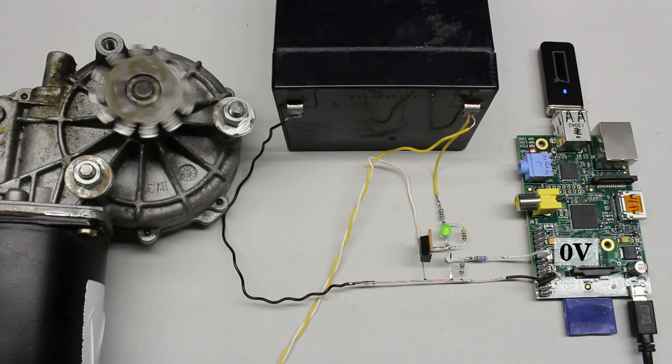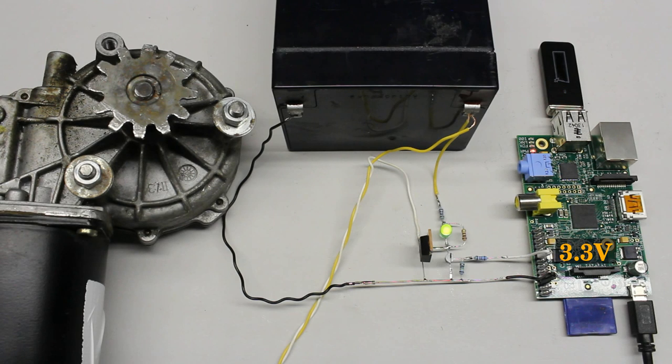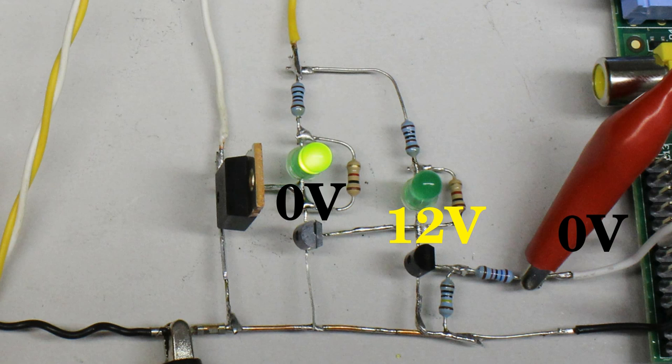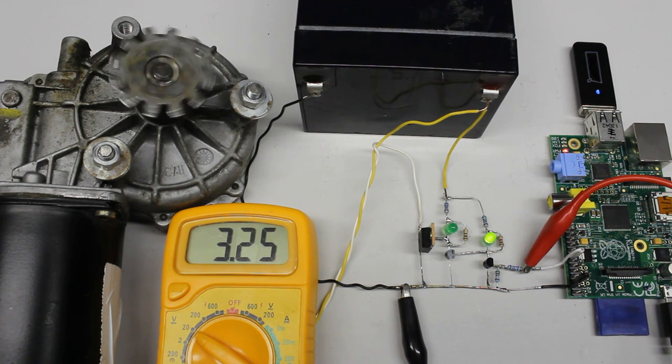The Raspberry Pi can control the motor, but the pin has to be turned off in order to turn the motor on and vice versa - the switching behavior is inverted. That issue can be fixed by software, but there is one problem: during the boot process this pin is turned off, thus the motor is spinning until the software is loaded. With another small signal transistor in the chain, the switching behavior is inverted for a second time. Whenever the pin of the Raspberry Pi is turned off, the first small signal transistor is turned off too, creating a voltage drop of 12V at the gate of the second small signal transistor turning this device on. Thereby the potential at the gate of the power transistor is 0V by which this device is turned off - same as the pin of the Raspberry Pi. When the pin is turned on, the power transistor is also turned on through the second small signal transistor, thus the motor starts spinning - which is the normal switching behavior.